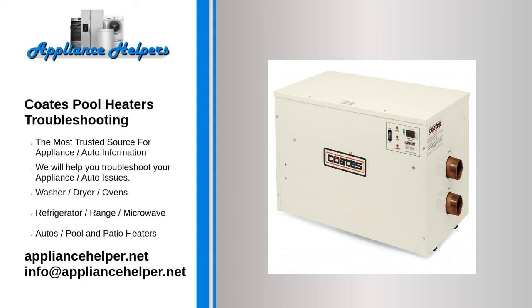Check the system's valves as well to make sure that they are turned to go through the heater. If this does not resolve the problem, make sure you are using the right size of heater for your pool. If it is too small, it will not heat properly. The pool manufacturer's product literature will recommend the right size heater for your pool.